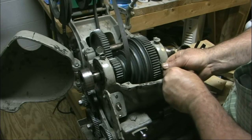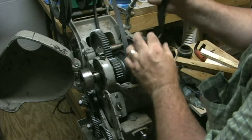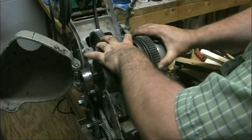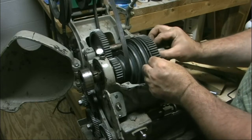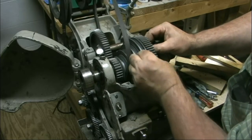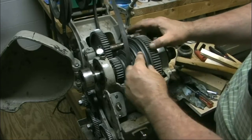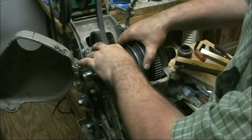I'm going to lift this key up and pull it out with the needle nose pliers. There's the spindle key for the bull gear. In theory it should just spin now — and it does. The pin is free, so I'm a little confused as to why it was frozen. But the pulley does not spin — it's like it's seized on the shaft.